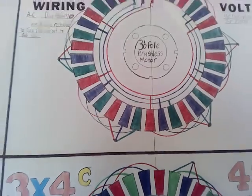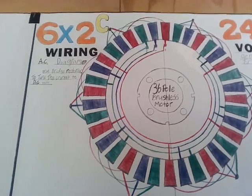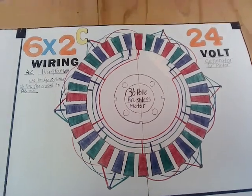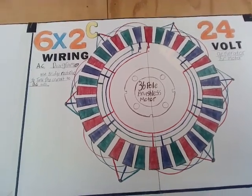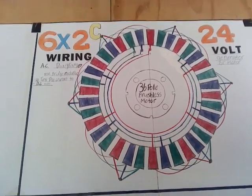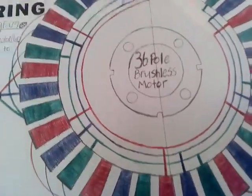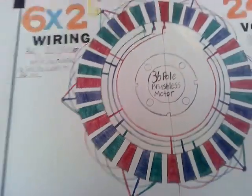Alright guys, so one of my subscribers was asking me about this. What is that? Well, it's the 24 volt wiring diagram. That's 6 times 2C. That's 6 groups of 6 poles wired within the whole series of 36 poles. That's what that is. And if you look in the middle here, you'll see it all color coded, because that's where you have to wrap that other wire around. It's all the way around there, and I'll show you right now about that wire.